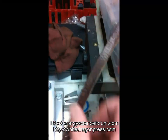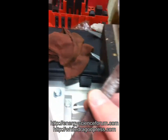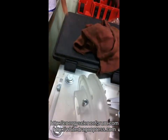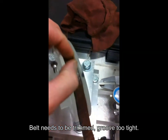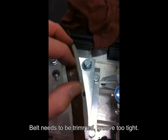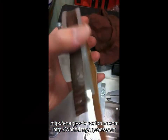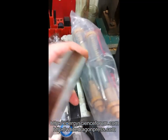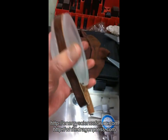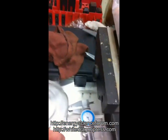This is a leather belt, and these are calibrated spring-loaded scales that you can attach this belt to so that you can see how much the deflection is. This belt will fit in here. As this wheel spins, it's going to pull on the belt in one direction or another depending on how it's spinning, and based on the pounds reading you can determine how many foot-pounds you've got going on.